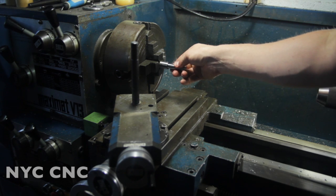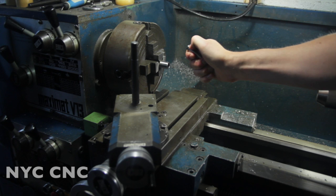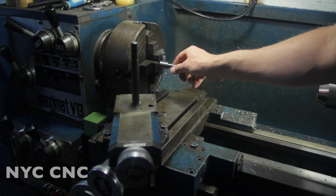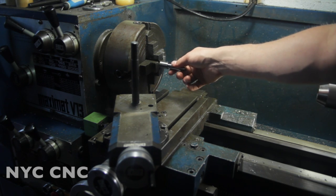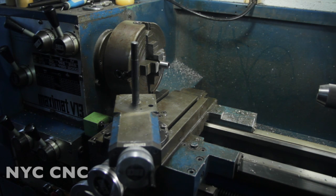490. Fits in for a little less than an eighth of an inch. So we've obviously got some taper from the drill. That's not surprising given how much we had to peck it. And so what this tells me is the front part of the hole is something between 480 and 490. Let's grab our 499 reamer, run the reamer through it, and then see where we are.